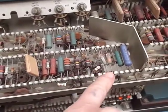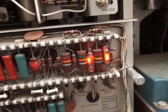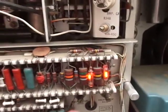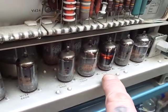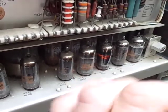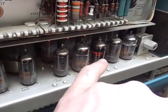We've got two neons there — one is lit, the other isn't. There are a couple of neons doing a similar function — they're both lit. Basically those neons are just regulator tubes, like this valve V609 here, which is regulating all the power supplies. This regulates the negative 150-volt power supply and everything else uses that as a reference.